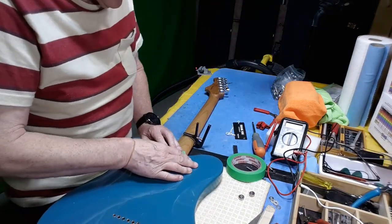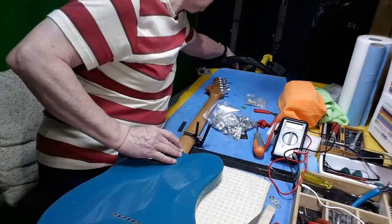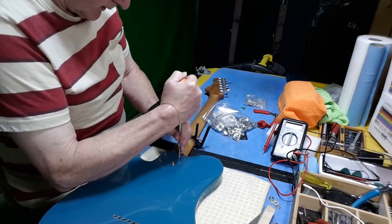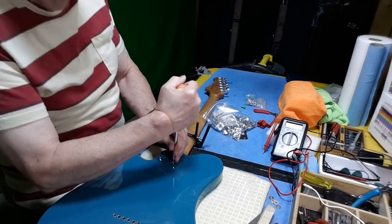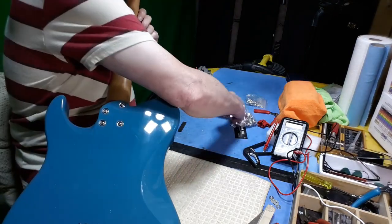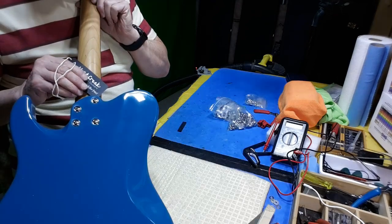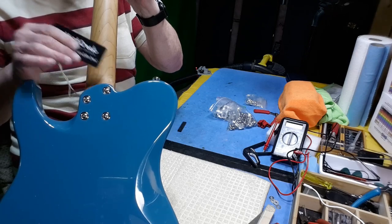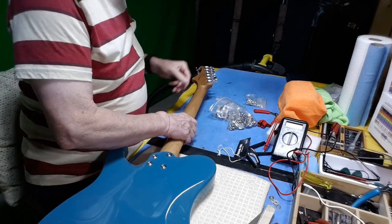So we're going to try it with no shim. No shim, but back to the washers. I might get one more flat washer in there now that it's compressed way down. Is it flat now? Tiny bit better. Okay, the card won't fit in there anymore, but will it? It will, just on the edge, just a tad. But it's completely tight here and not there. I'm going to check with a ruler later how that worked out.